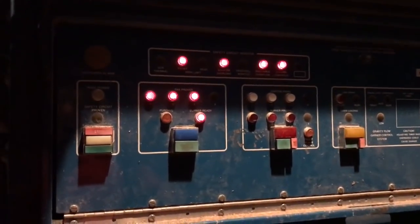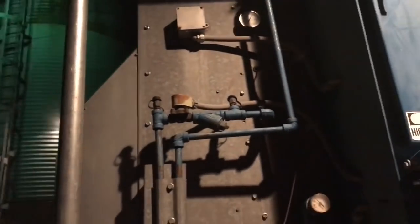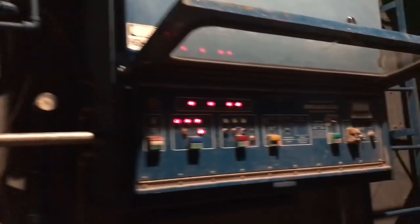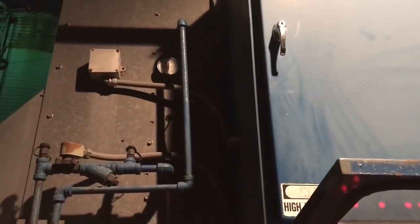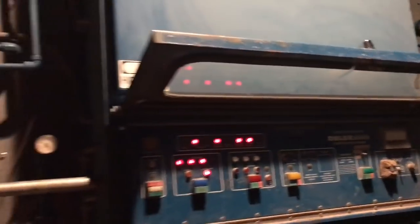The thing with the turn-off process: you hold the fans on, shut off your burners, and leave the fans running. The temperature drops rapidly when it's 40 degrees out — I shut it off about 15 seconds ago and it's already dropped about 40 degrees. The steam comes right off. You can hear the wet bins getting louder — the dryer has just finished filling. I've shut off the unload, so there won't be a need to put any more in unless it shrinks a little bit. I'm going to let this cool down and get it as close as I can to air temperature so I don't damage anything. I've shut off the unloading, so now I can run around and shut off all the dry legs, the U-trough, and the spreader.